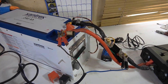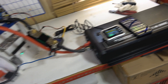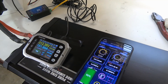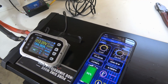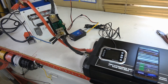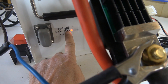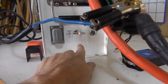Let that go for a little while. I've had that running for a few minutes — handles it no problem. It also says it should handle up to 300 amps for three seconds max. So I started cranking up the heat gun to see when it shuts down — up over 180, then 200. It's kind of working as advertised for max discharge. You can see some error lights: a red one and a flashing green. The manual says that means overcurrent protection — makes sense.